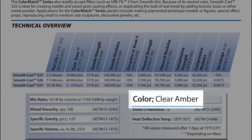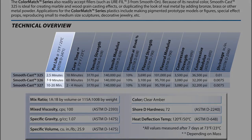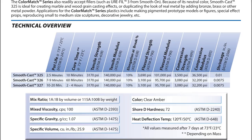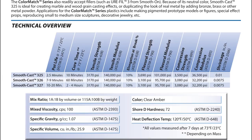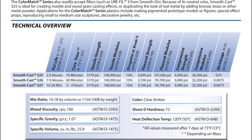The first thing we care about for resin is the body color — the core color of the cured resin with no additional additives. A translucent resin gives very different aesthetic results than an opaque resin, so be very aware of which you are choosing. You'll probably notice a lot of similarities with the silicone spec sheet, but given the different applications, we don't necessarily want to prioritize them in the same way. Resin hardens very quickly once the pot life expires, so it's vital that there is enough time to fully accommodate your workflow — err on the side of longer if you're not sure. Keycaps are friction fit and can take quite a beating, so resin hardness is very important for durability and performance. Carefully consider your application and what to prioritize when choosing which resin to use.